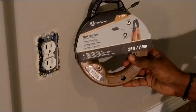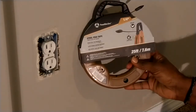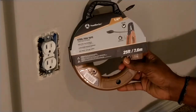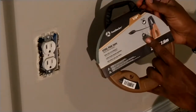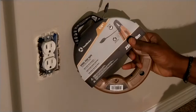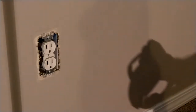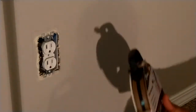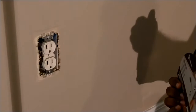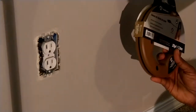This is the outlet that I just opened up, and now using this outlet we're going to power the ceiling outlet. We're going to use the steel fish tape — I bought it at Lowe's. I know a spot in the attic where I'm going to use this end of the steel tape, put it in, and it'll come down here. Then I'll fish it and try to get it out from this box. Once we get that out, we'll use the same fishing tape to take the electrical wire from here up through the attic to the ceiling.